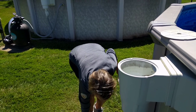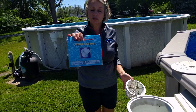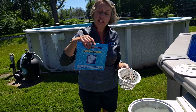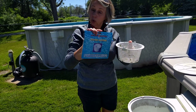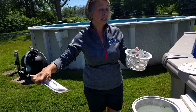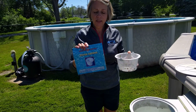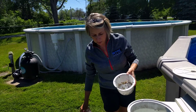A great product we sell is filter savers. These are life savers — there are five in a bag. They're little mesh socks that fit inside the skimmer basket and they're going to catch a lot of the fine things that would normally pass right through here, right through your pump basket and into your sand. Very good for keeping this clean. Make sure you take it out or check it at least once a day — it gets filled up pretty quickly.